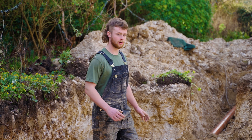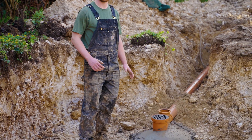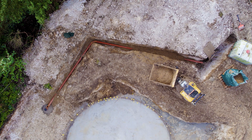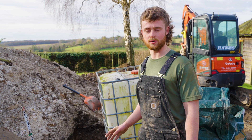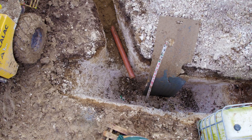Before we can get any mesh in here to pour concrete over, we have to get all our drainage in. This bottle gully is set at the same height as the finished slab — it will drain any water that collects through here and send it towards the soak away. Before we put a soak away in, we need to conduct some percolation tests, which help us determine how big the soak away should be.